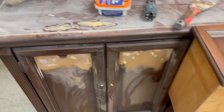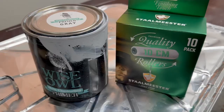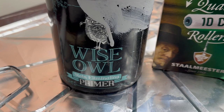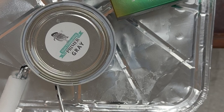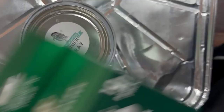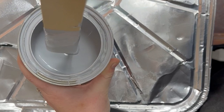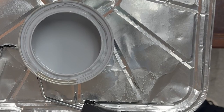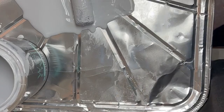This dresser didn't have much damage to it — it was in pretty good shape. I caused quite a bit of damage but I filled in everything with wood filler, sanded it back, cleaned it off, and it was time for my favorite combo. I started out with the Wise Owl Stain Eliminating Primer in gray. This primer is great to even out the surface because I used wood filler and removed bits. It was important to get the surface all even and ready for painting so I wouldn't have to worry about any bleed through. This primer comes in four colors and I really like it for that, especially because it comes in a dark gray for dark colors.